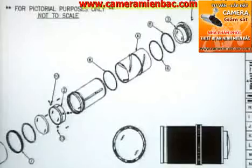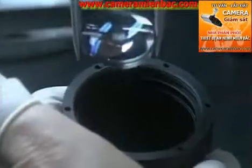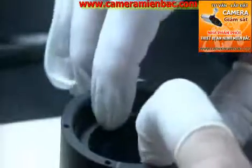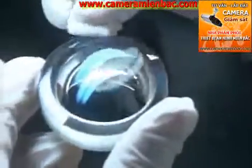They double-check the design for this complex optical system and begin to pull all the pieces together. A singlet, or single lens, goes into the metal barrel first, followed by other lenses with various curvatures and dimensions. She places metal spacers between the lenses to separate them — proper spacing will prevent aberrations in the image, such as blurring. Between installations, she covers the barrel with a piece of lint-free plastic because eliminating dust continues to be a necessity. One fleck could ruin this entire assembly.